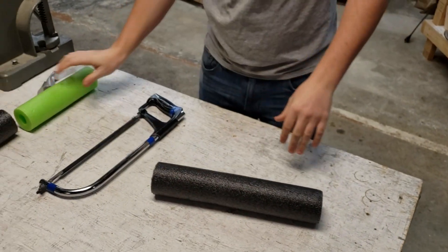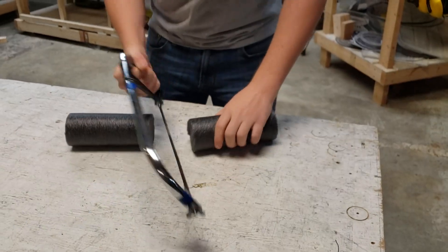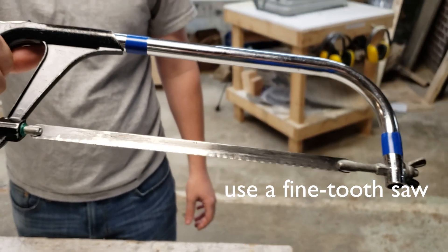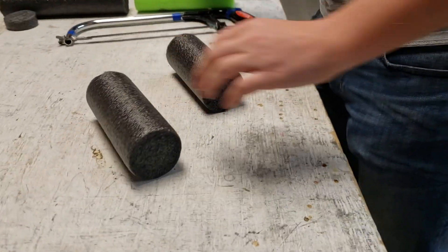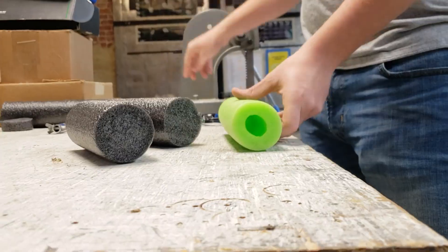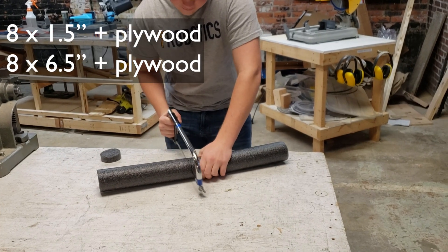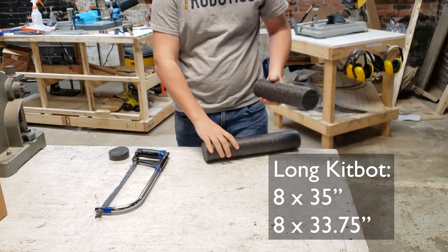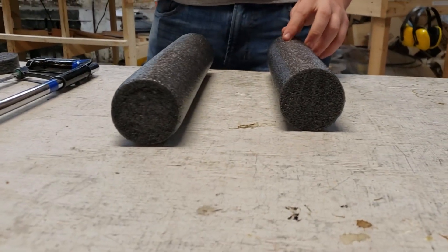We will link a supplier in the description, but you may be able to find them cheaper at a local pool and spa supply store. Per rule R25, the pool noodles need to not just cover the plywood but also fill in the corner gaps as shown in figure 9-7 in the rules. This means you need to cut eight pieces that are one and a half inches longer than the plywood and eight pieces that are six and a half inches longer than the plywood. For the KitBot in the long orientation, that works out to eight pieces 35 inches long and eight pieces 33 and three-quarter inches long. The longer pieces will actually go with the shorter plywood for the front and back bumpers once you get to assembly.